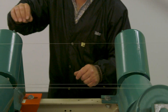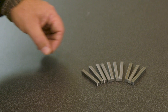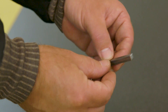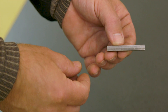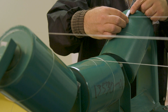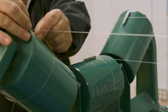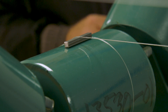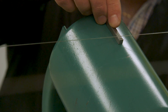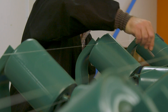With the strings installed and tight, we can now see if any of the idlers are sitting lower than the rest, but not if one or more of them are too high. Now we add small pieces of keystock, also known as machine keys, keyway stock, or square mechanical steel bar. These pieces are cut into 50mm or 2 inch lengths with ends that are deburred. Three pieces of keystock are placed between the string and the roller on each of the first and last idlers, making sure they are at the highest point of the rollers. Now the string is sitting up off the rollers by the thickness of the keystock. We use another piece of keystock to examine each of the rollers on all of the idlers in between for alignment. This method can tell us if the idlers are too high or low with respect to the first and last idlers.